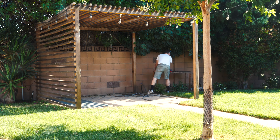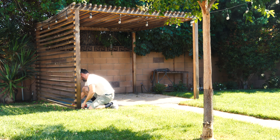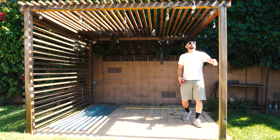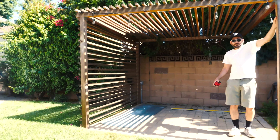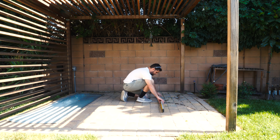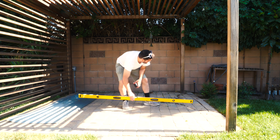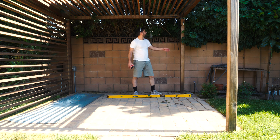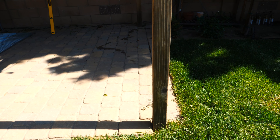I'm going to show you every step I took to make this beautiful outdoor kitchen. I started with this job site, which is essentially this existing pergola. The problem is this thing is really rickety. We have a lot of things to overcome: the ground is more or less level but has peaks and valleys over these pavers, and these posts are not in alignment — in fact they're not even plumb. We're going to overcome that over the course of this build.